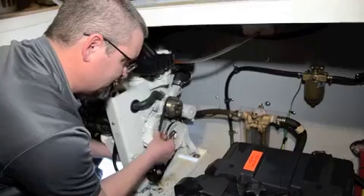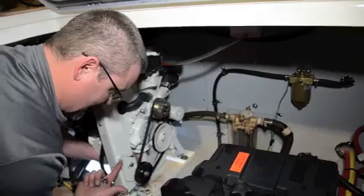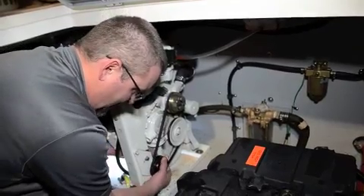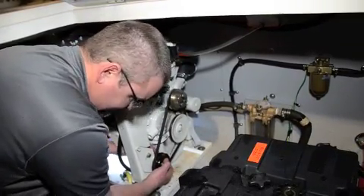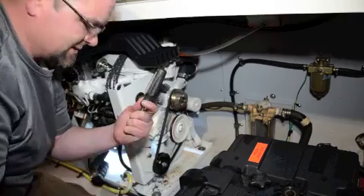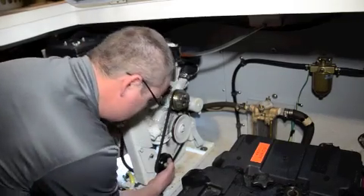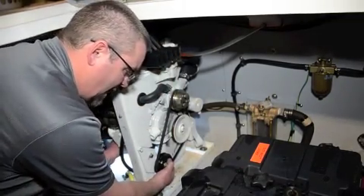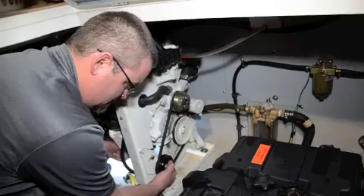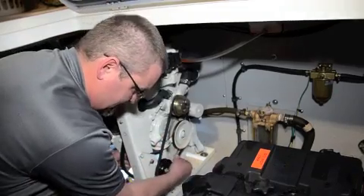On this one we're going to have to set our belt tension. We've got our belt tension bolt and then a mounting plate bolt. I'm going to pry this back towards me — I'll use the rubber handle of this nut driver so I can pry against it without scratching any paint. I can pry harder this way, so I'll pinch it in and push back to get that belt really nice and tight.